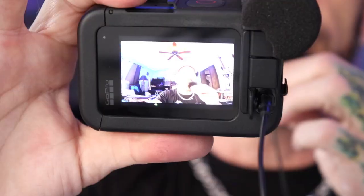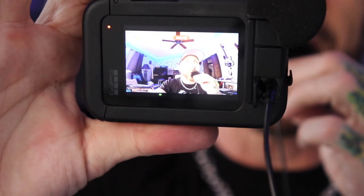I thought it was going to be that easy, but I went out to film a video and when I got back I had no audio recorded at all. That's because of a certain thing to do with this particular lapel mic. If I hit record on the GoPro now, you can see it's recording but there are no green audio bars moving at the bottom at all. In the GoPro itself, there are settings to change the microphone to a powered mic or make the mic input higher, but that doesn't fix the issue — no matter what settings I used, still no audio whatsoever.